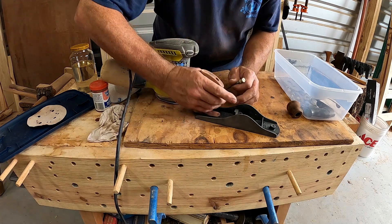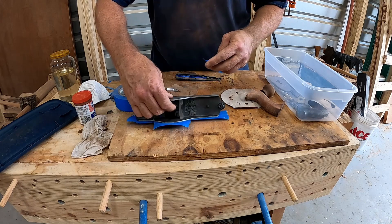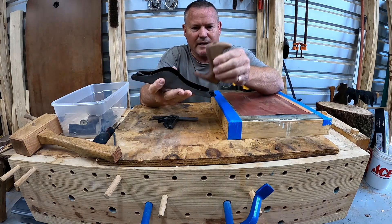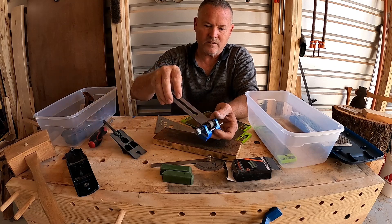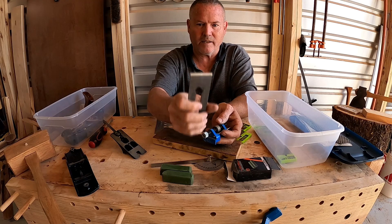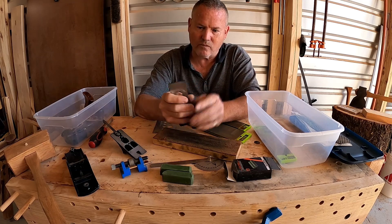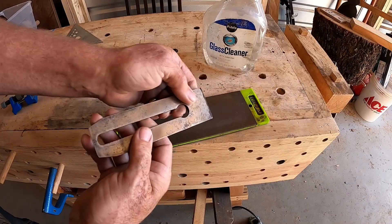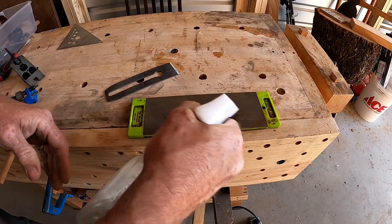The lateral adjustment disc came off so I'm going to try to tap it back on now - somehow without breaking this thing. I have to be super careful doing this. I'm going to see if I can squish that back down on there - it needs to be spread out more. I don't have a punch so I'm going to use a Dewalt metal bit to spread this out so it doesn't come back off. So the way this works is you see how it sits inside and now you have the lateral adjustment - that's how that deal works. Looks like that's fixed. Everything is straightened out, so now we need to start working on the handles and sanding these things up.